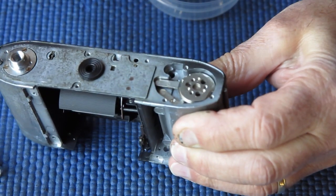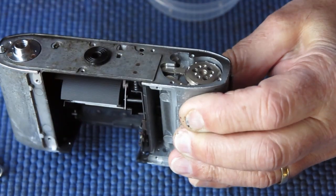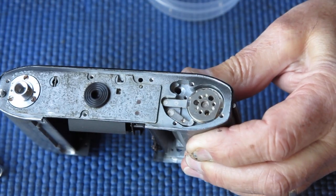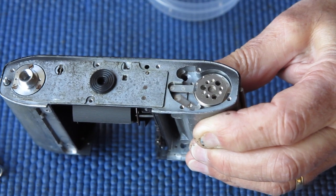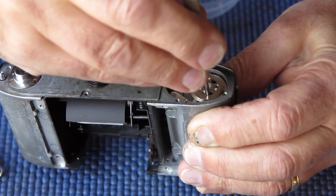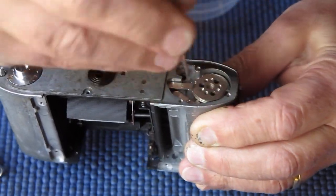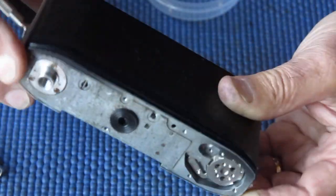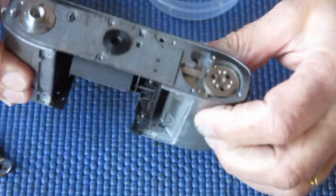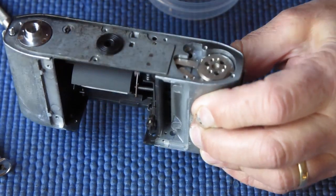And three screws. Thought that one had tipped over on its side. That's always entertaining. You've got to fish them back out and start again. And it wasn't the case. One screw started. Check that everything else is in line. Check that my film spool is pressed down. That's smooth. It's moving. It means that that spring didn't fall out of place. And I have two more screws.